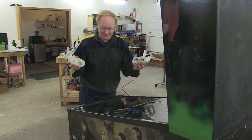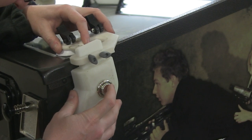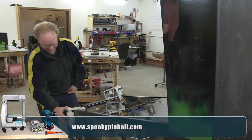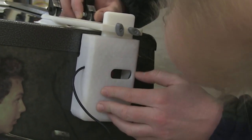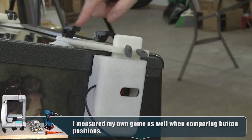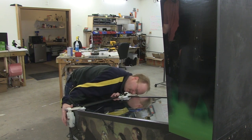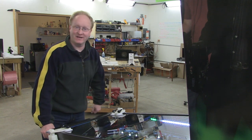I'm installing both halves on the America's Most Haunted pinball machine — it's out in the open and easy to film. I measured our own game when I measured the others to find common ground. Tighten the knobs, then activate the suction cups — it's like a robo-octopus. There's a window on the actuator side to see and feel that the servo is hitting the button correctly. The L-shape clears the lockdown bar. With the servo aligned, it's time to play pinball one-handed.